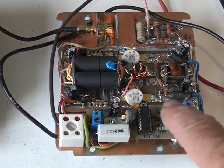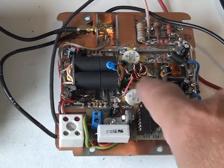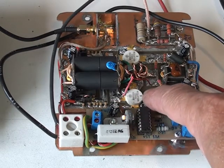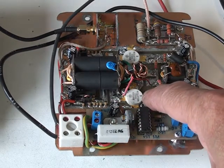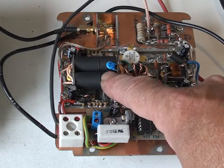If you're building a high-powered RF amplifier for your transceiver project, something like this 100 watt design using a pair of MRF454s, you'll need to possibly use one of these output transformers.